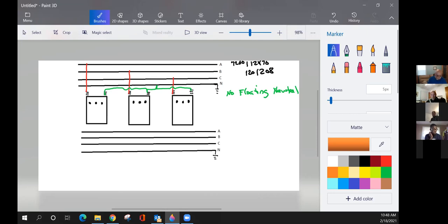All right, now we've designated that we've got this transformer with the windings paralleled inside. We're going to use the two outside bushings because we don't need the third. We're going to use the right-hand bushing on this transformer as our neutral. Now we want to tie our neutrals together on the transformers themselves. We're going to parallel all three transformers to get the same voltage out. We just want 120 volts out of each transformer. So we're going to tie our neutrals together. Notice he uses the same bushing on every transformer. Correct, all right-hand side. That's our neutral.